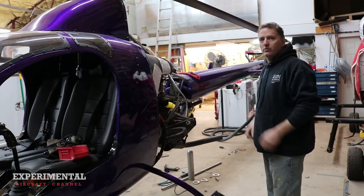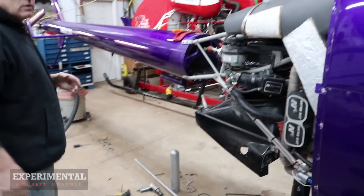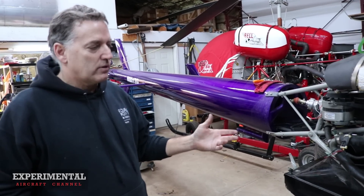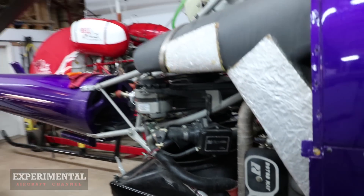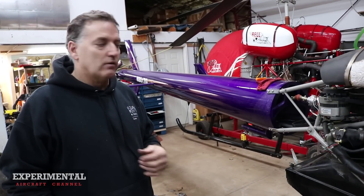This is 150 horsepower, water-cooled, vertical engine. I had no idea RotorWay made their own engine — what is it exactly? RotorWay is one of the few that makes their own engine. They originally started in the 70s with Evinrude engines, found out they weren't enough, and started developing their own. They've come a long way over the years and have all the small stuff figured out.